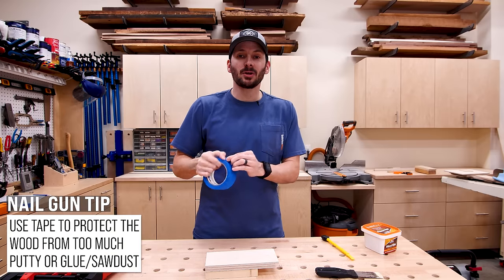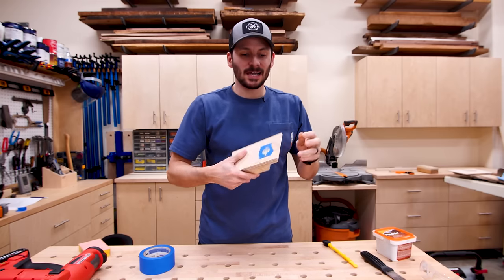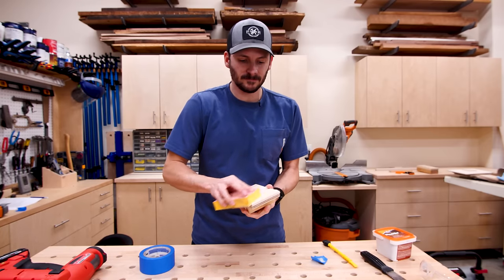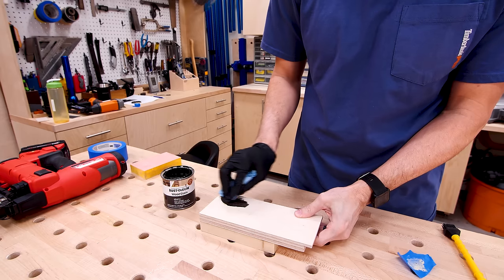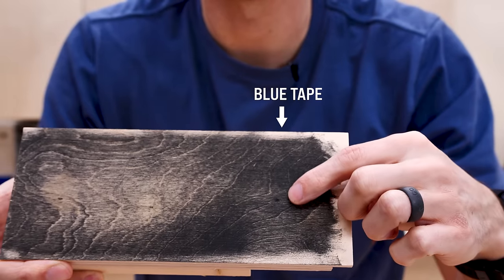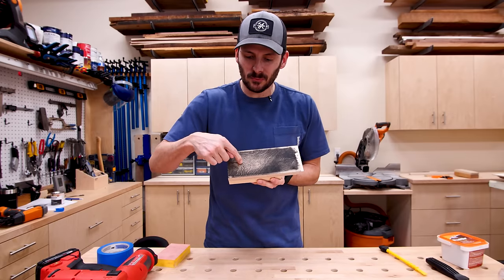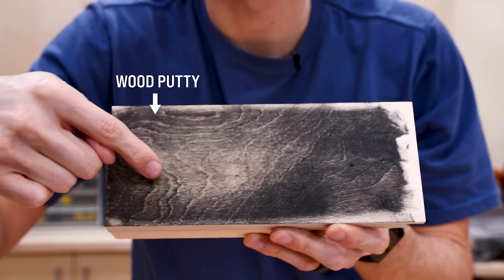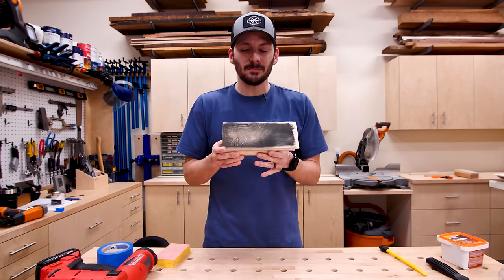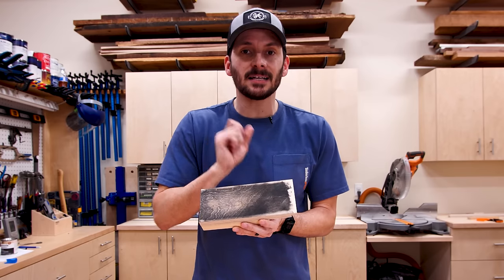Here's a trick to solve it so you've only got the putty right where the nail is. Get a piece of blue tape and put it over wherever you're going to brad nail, shoot the nail through it, then cover it with wood putty. When it's dry, just take off the tape — all that excess goes with it — and clean it up with just a few swipes of the sander. After applying dark ebony stain, you can see how much darker and richer the taped area looks because there's no extra putty filling the pores. The untaped areas are lighter and show a circle around the nail hole. If you're filling holes and applying stain, use the blue tape trick so it won't affect the finish at all.